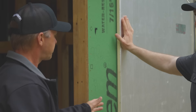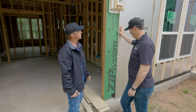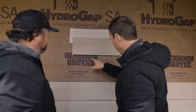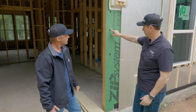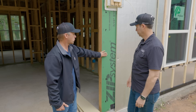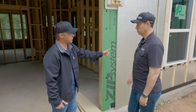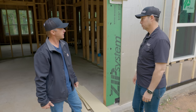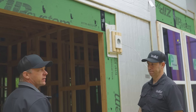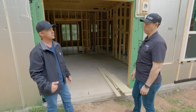So in this case, we have two drainage planes because the other one is on the outside of the insulation. I did a video just recently with my buddy Wade Paquin up in Rhode Island where he had a textured house wrap and was putting Boral siding right on top of it. We put a piece of that right up against the WRB, poured water back there, and sure enough that water drained right out, even though it looked like there wasn't much space at all. So I like this idea, Scott. What is this product and how did you get this texture? This is just a silicone — that's all that is. Just a cheap silicone applied with a notched trowel to knock it down and keep them all consistent, spaced on maybe one-foot centers around the house. It took about an hour for a guy to go around with a ladder and do it all.